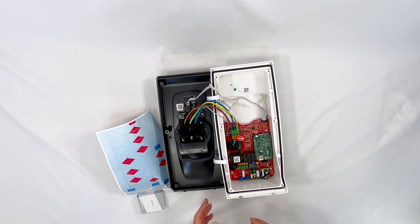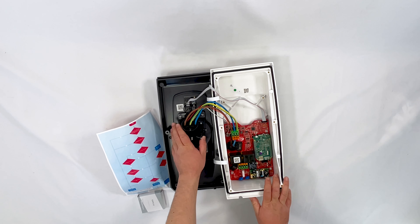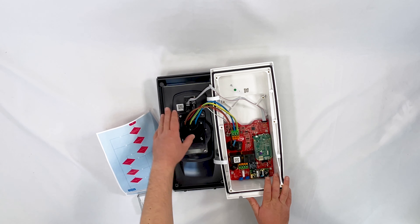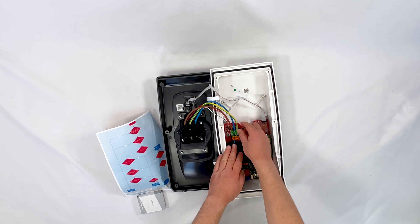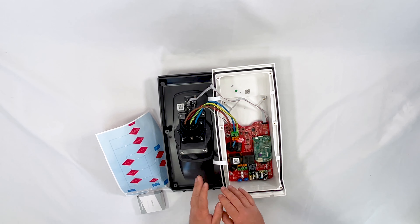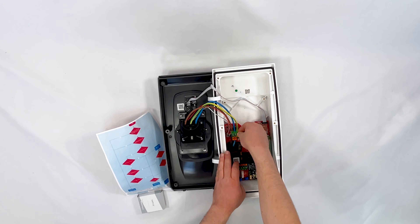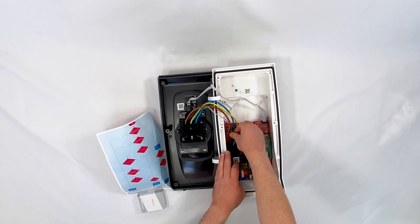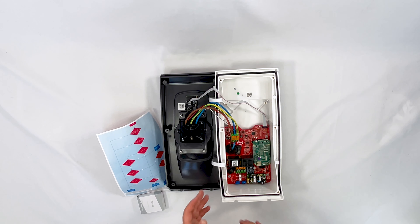There's also another use I've just realised from testing this charge point: if the front face plate had a fault, or any of the circuitry in there had problems, they could actually just replace it by unclipping these WAGO-style blocks and sending you a new front section if they detected an issue. Really clever idea - giving the engineer two options, installing it in the combined way or separating the units and plugging in later.